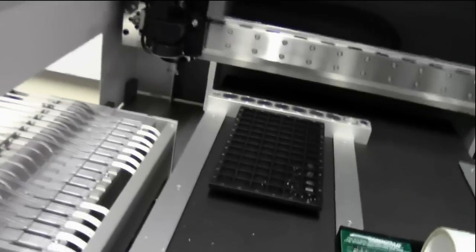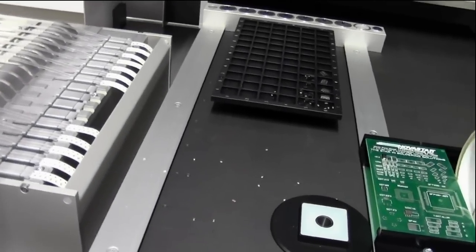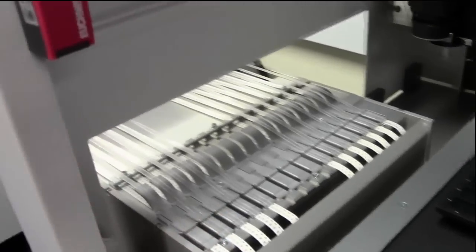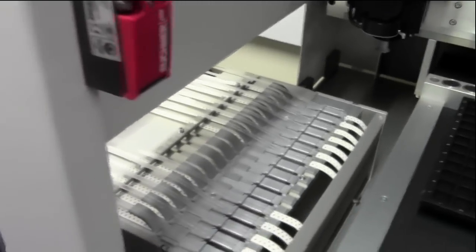This lane over here will be lane 20, the feeder, that will have a different lane number. Carrier doesn't have a lane number because you manually place that yourself. That's something that you set up in the software to say your components in the component feeder, this is where the feeder is and so on. But the lanes are addressed, and likewise you've got another position for another feeder, tape feeder or a reel feeder or a vibratory, and the other end that'll have another lane address.